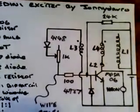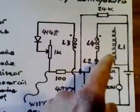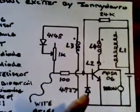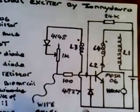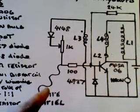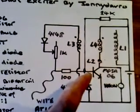This is the circuit diagram we're going to be using today and I'll upload a link to it in the more information section. The large coil is the one I just showed you and the small one is at the base. L3 and L4 is the Bedini coil and the dots indicate the start of the windings. This first diode can actually be taken out but I've left it in because it changes the frequency of the circuit. The second diode is blocking the return path to the top of this coil - it's fairly redundant but it alters the circuit characteristics so I've left it in. The piece of wire acts as an aerial, receiving a signal and sending it to the base.